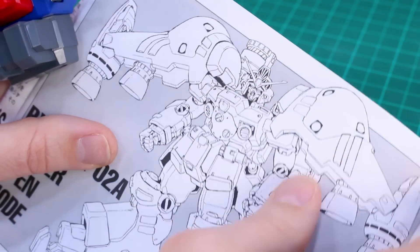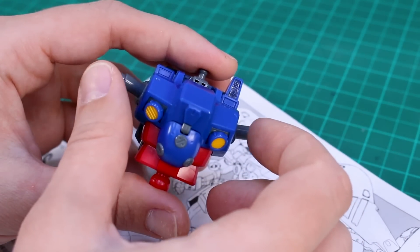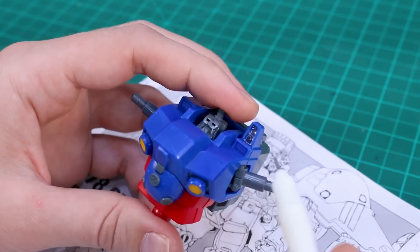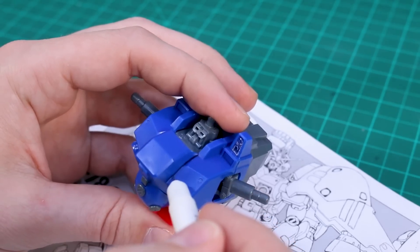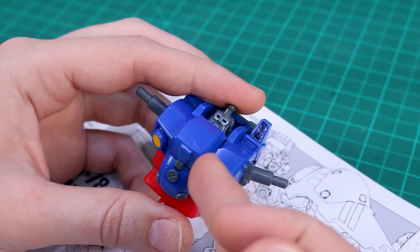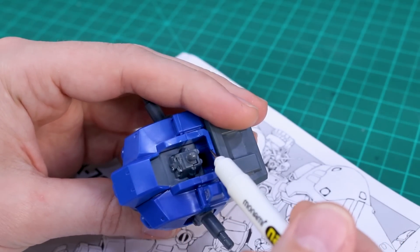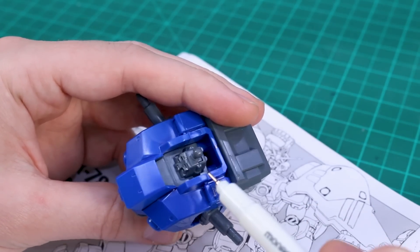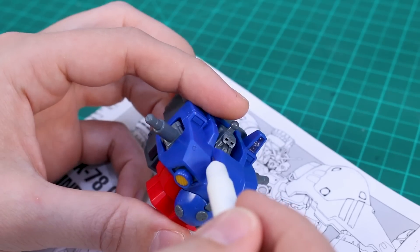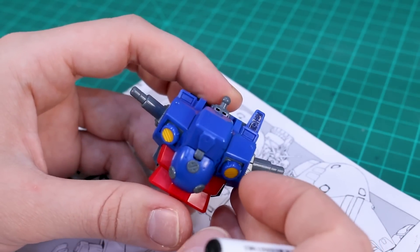I don't think I'm going to mess with the height - I'll just leave it as is but make it wider. What I'm going to do is two things: add a layer of pla-plate on the outside, then cut this apart through the middle section and put a layer of pla-plate in between. That'll expand it out and make the collar section wider too. I'll add one millimeter onto the outsides - that's two millimeters - and one millimeter onto the center section on each side, so totally it'll be four millimeters wider.